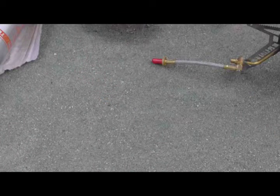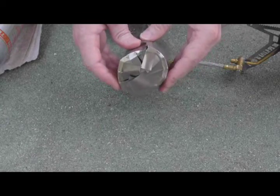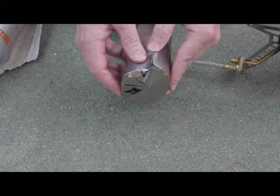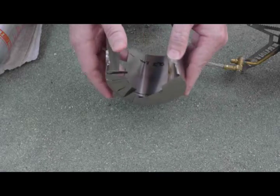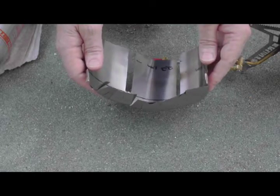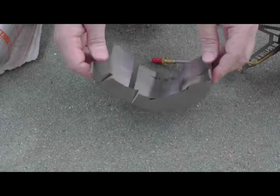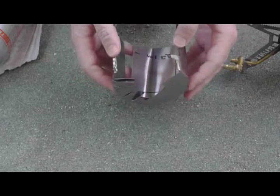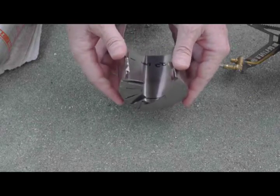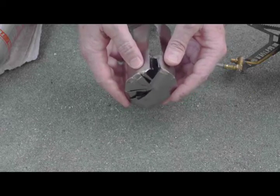Here is another variation based on the same idea, but the leaves are closer together with much less open space. I found that despite that, the leaves still allow quite a lot of the gases from the preheating portion of this operation to escape. It actually worked much, much better than the one I just showed you, but it is still not as efficient, believe it or not, as the pop can.